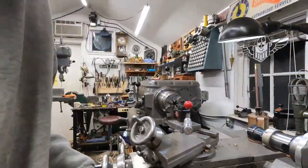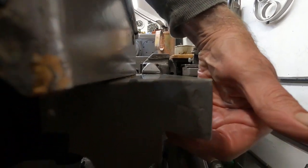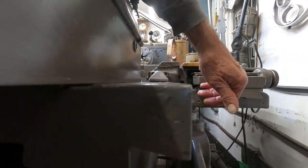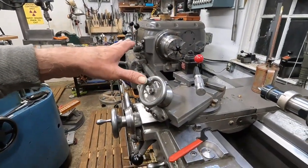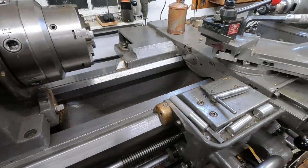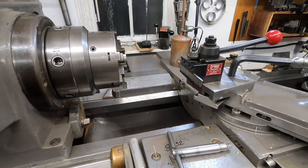You want to back those off too, both up front if the machine has them. All machines have a gib. On the Axelson it's tapered so it's kind of touchy, but make sure it does not get tight. Loosen all the gibs, then find where the carriage still gets tight, and adjust the gibs accordingly. You'll get the best result — it's all a compromise for sure, but everything generally is.